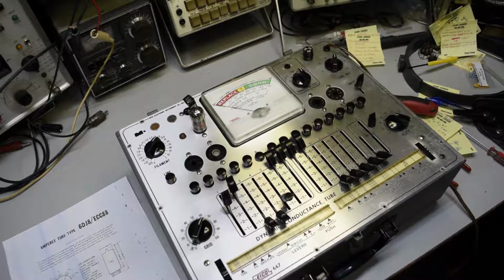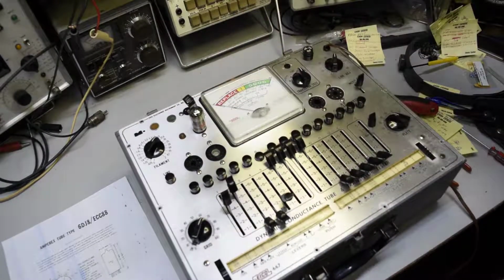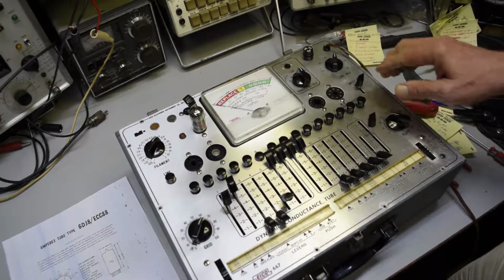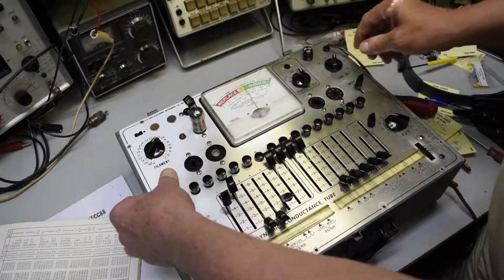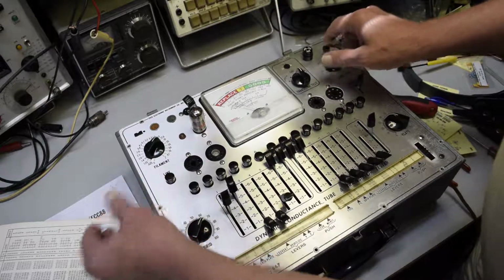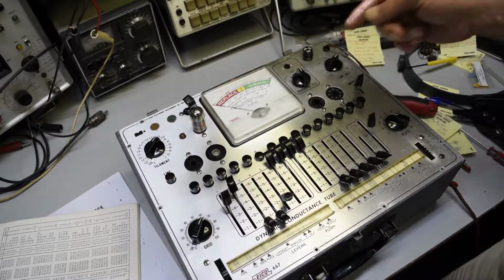See, excuse me, all the other charts got it all boogered. It has different bias voltage and plate voltage, and it should be the same. And check the line voltage. I got to set it back up. It's a little low. There. Oh, I forgot number 1.